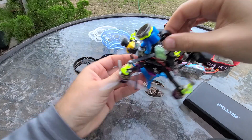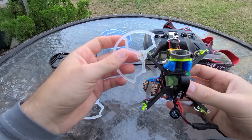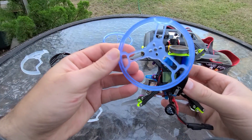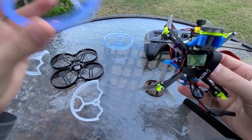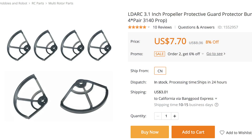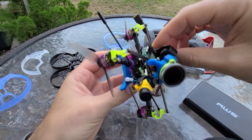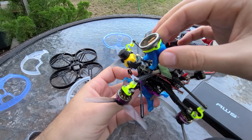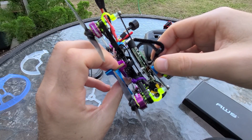It's lighter, it's quieter. And if you want to put prop guards on it, I took these prop guards — I'll link them in the description — and if you just trim them like this, you can have prop guards. You can't fit full prop guards on this thing because the frame is just a little too small; the prop guards will bump into each other. However, there are tons of partial prop guards online. For anyone who digs this design, the flight characteristics, and wants to build one, I highly recommend it. And for anyone who can help modify this camera mount to make a legitimate 25 or 30 degree mount without me doing a janky design on it, that would be amazing.